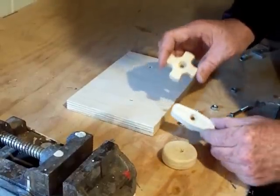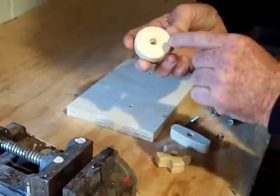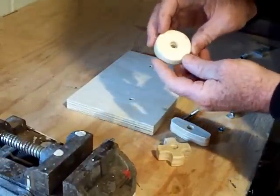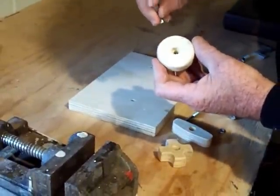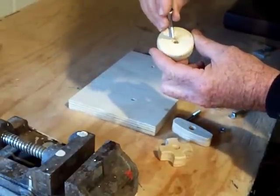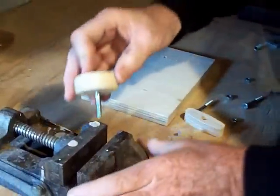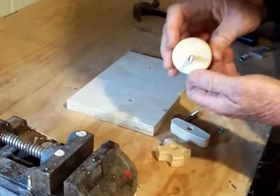I just cut out three quick samples here. This one was cut out with a hole saw, and the quarter-inch pilot bit was just the right size. Afterwards, I drilled a 7/16-inch hole, which matches the head size on this bolt that I'm going to put in it. If you use a 7/16-inch wrench on it, that's what size hole you're going to use. You basically place it, and you can see it covers the hole. Put it on a hard surface, give it a couple good hits, and there you go — it's in. That's it, you're ready to go.